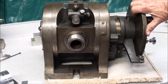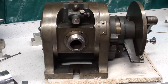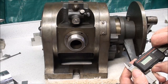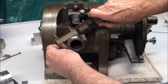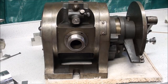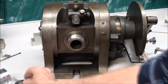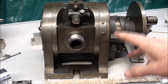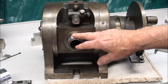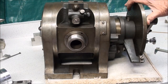No problem - I'll just adapt one of my chucks, or maybe one of my chucks will fit. Well, wrong. Even though this is a two-inch diameter - which I thought was pretty common - and it's eight threads per inch, which also sounds pretty common, there is no chuck available, no backing plate. So I've got to make my own, and it's really kind of a chore, something I didn't want to get into. But I think I'll go ahead and run a video of how I did this while I'm at it.